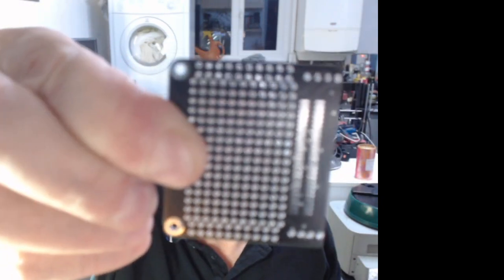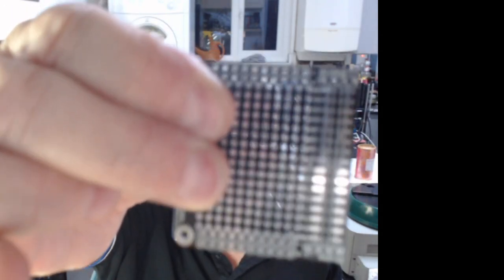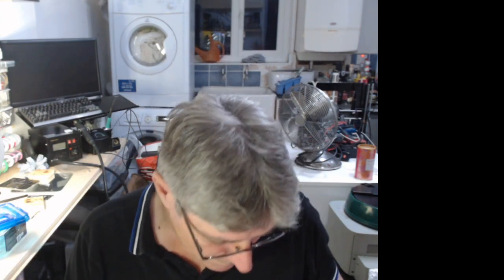That's the tile connector on the bottom, and on the top is a 2.54 pitch connector, which I can use hopefully to connect to the logic analyzer. So I can just plug this tile in and use it not only as a prototype, but also as a connection to the logic analyzer, so I can divert pins inside the FPGA to there and monitor those. So we'll probably do that.